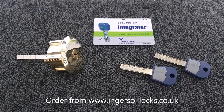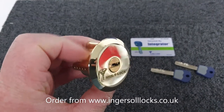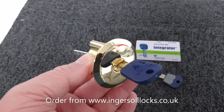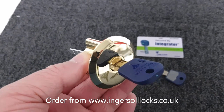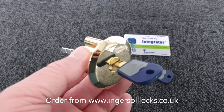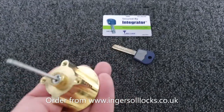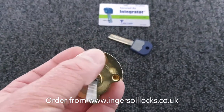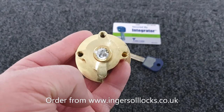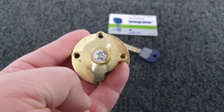The Multi-lock cylinder sits on your door with the keyway horizontal instead of vertical. It's a bit easier to use because the key can go in either way, like a car key — you can insert it with the blue face up or the gray piece up and it will still operate. On the back, only three of the four fixing holes are used; the last one is blanked off because that's where the cylinder's pin mechanism is located.